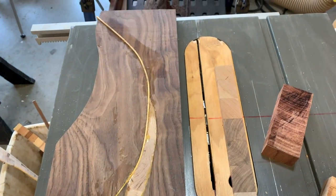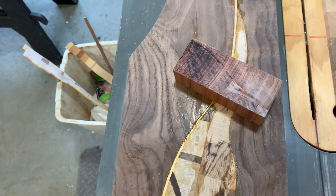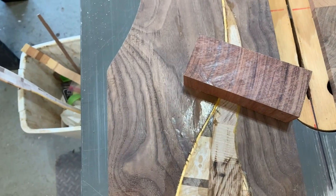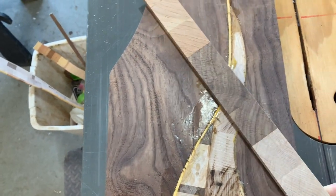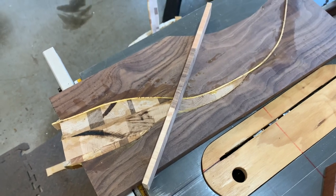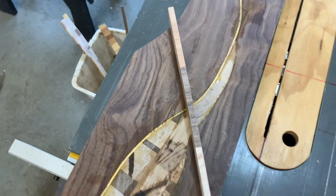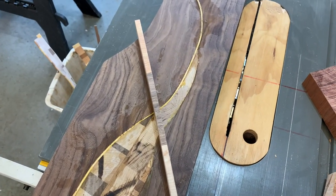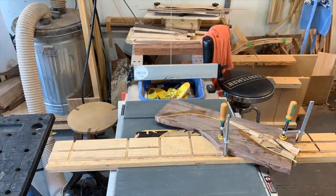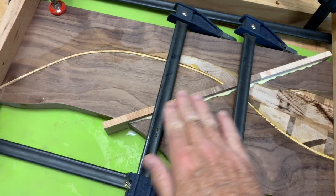For this board I'm trying to decide how to work in this block of padauk — it has a nice reddish texture — or work in this straight piece and do a straight cut across there for something a little different. I think I'm going to start with the straight piece since it'll be easier to make a straight cut across there and come back and do the other. To make a straight cut across a diagonal on this board I put it on my straight-cut or taper jig.